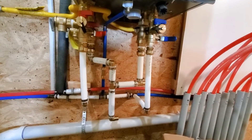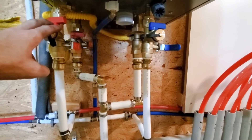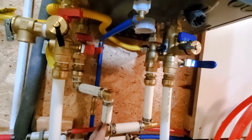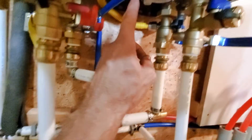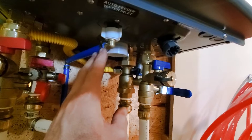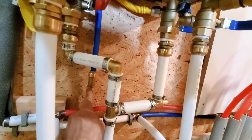Here's how my spaghetti works turned out. Everything up here is tightened down and good to go. I almost forgot to put the makeup line in, but I was able to add that before I tightened all this up. I did mention earlier that you need a backflow preventer here, since this goes straight into your boiler line. Without one, it could potentially take fluid from your radiant heat and put it back into your water supply.